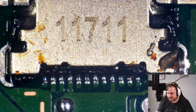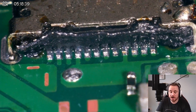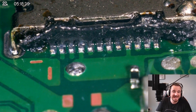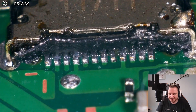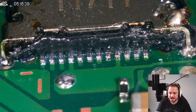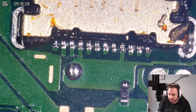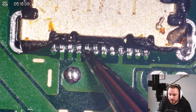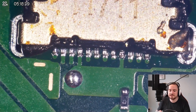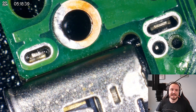I don't personally think this is an okay job — I don't think it's going to work. I've melted the plastic and I have a bad feeling about this. I tried moving the air gun as much as I possibly could, with a temperature of 480°C and a fan speed of 6, then 7, then up to 8 to get in and out as quickly as possible. The connections look okay at the front but I'm 93.6% sure the connections underneath aren't soldered properly. I'll nudge each pin with tweezers to check — they all seem to be solid, which is a little bit of a relief. But the ones underneath I don't think are going to be. I'll fill up the rest of the holes with solder and then we'll put it back together and give it a test.